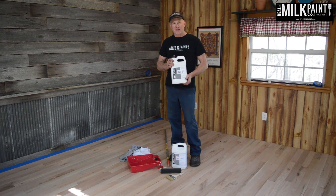We've done three coats today. You can see we got about 60 to 80 percent glossy on the floor, which is what you want to see. Because we're getting towards the end of the day, we're going to do the wipe-down process. All you need is t-shirt material — you can see where the puddles are. We want to wipe off all those puddles and everything that looks like a puddle. We want a nice matte surface with no gloss, so wipe off anything that looks glossy. If you're afraid of leaving footprints, start at the farthest corner and wipe your way out of the room — otherwise your shoes will puddle with oil and you'll leave those puddles behind.